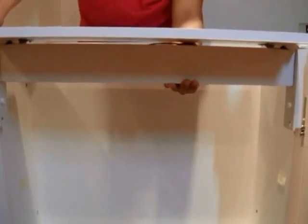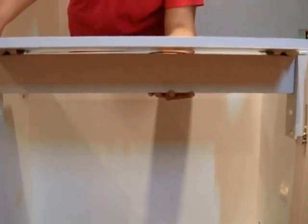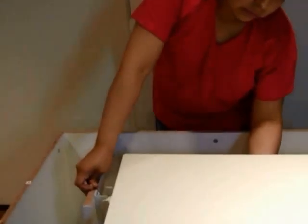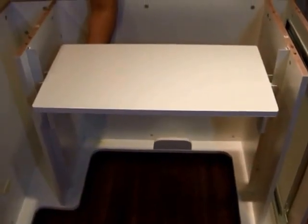Step 9 is attaching the lift and the lifter board to the cabinet itself. Pay attention to the orientation of the lift — you don't see any wires from the front, meaning the wires face the back of the cabinet and the smooth part of the metal faces forward. Take the plastic guides over the rail as shown, then take the wire edge and hook it onto the slot on the rails on each side. Once attached, push your lift down until it locks into position, at which point the wooden block should pop out.